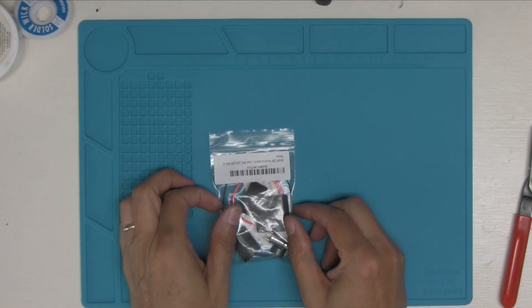The kit comes in this little bag and it comes in four different models. The standard comes with either a male or female BNC, and there are also 20 watt models as well. This one here is a standard with a male connector. The 20 watt versions are basically the same but come with a larger 82-43 toroid along with the 50-43. The build isn't too difficult, but the parts are pretty small, so you need to keep that in mind.